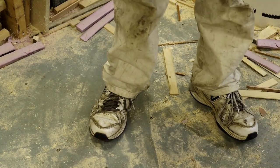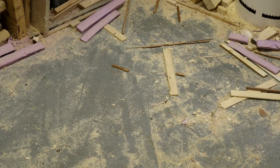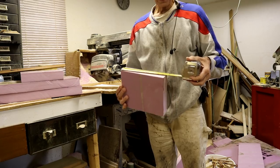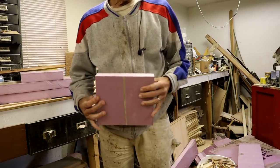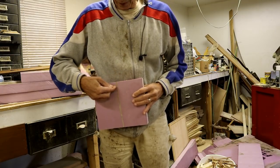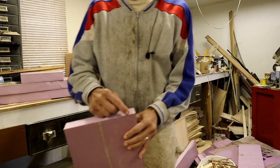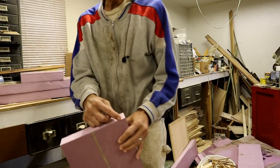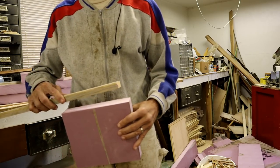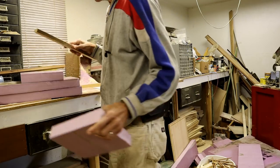Well, I guess we could go ahead and do the dado on the end bars. Now, on the long way, the 9.5 inch way, we're going to cut a rabbet joint in there. It's from the top of the 8 inches, it's down 3/4. And we're going to come back in here 1 1/8 inches. And what that does, I'll show you here in a little bit, that'll let a piece of wood glue and recess in there, and that'll be the bottom part of our frame rest.